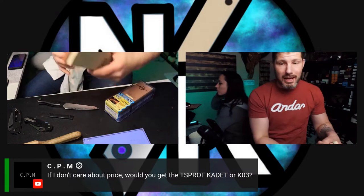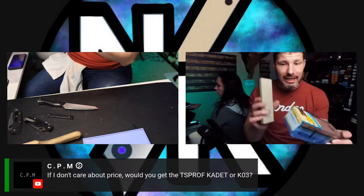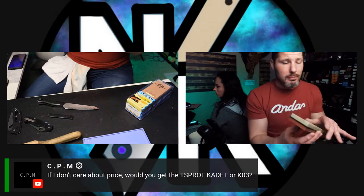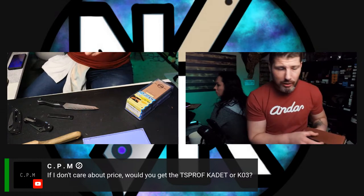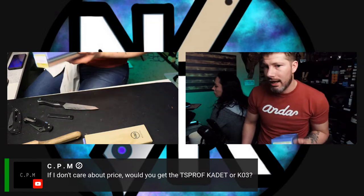Now, I will recommend whoever wins this, I'm not giving you this stone, you might want to get the 1000, 6000 to go with this. The beautiful thing about the 1000, 6000 is they're harder, they're more splash and go. You still want to get them wet and soak them, but you don't have to soak them as long. But these ones are definitely softer, so they're going to need some flattening after a few sharpens.